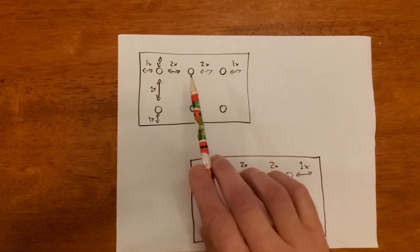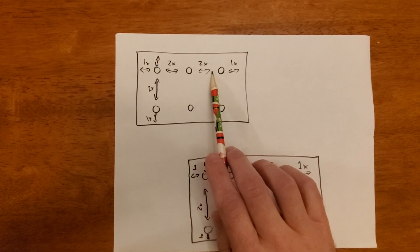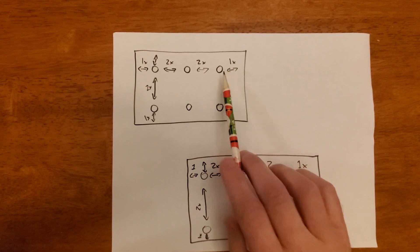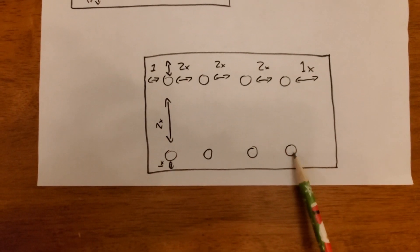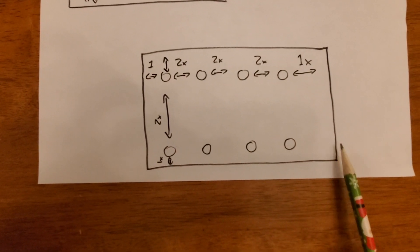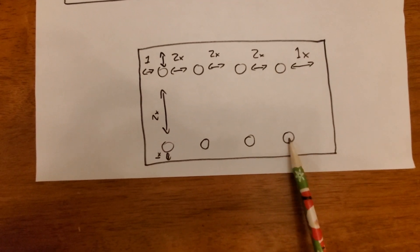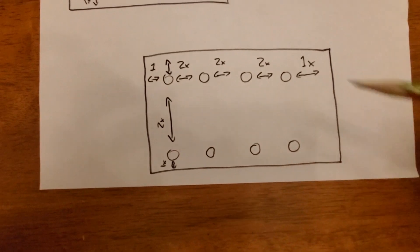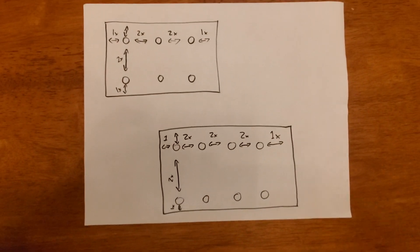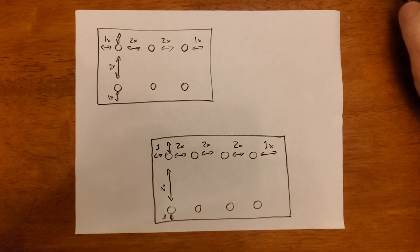Same this way — this would also be 48 inches if this was 24. With eight pot lights, we're doing the exact same thing. Let's say you have 30 inches from center of pot light to your wall — then you want from pot to pot to be 60 inches. That should give you the best spread of light. It'll make it pretty even in the room and it'll look good.